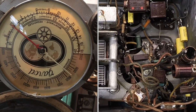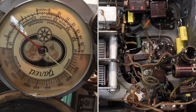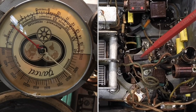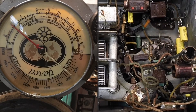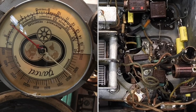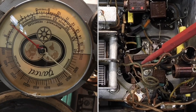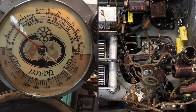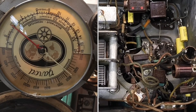Let me get in here and get this particular capacitor replaced, if these storms hold off. I don't have the silver mica caps with great stability to put in here, but I'll place another cap in there on a temporary basis that should be better than what's here, and we'll see if we improve the stability in the oscillator section. I still need to get back over here and do some deeper checking on this padder adjustment as well.